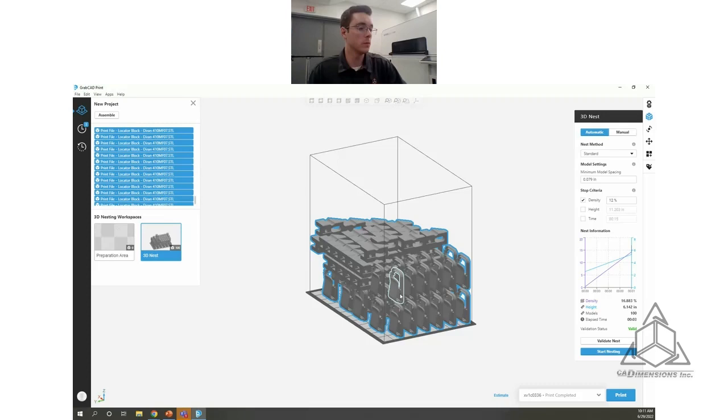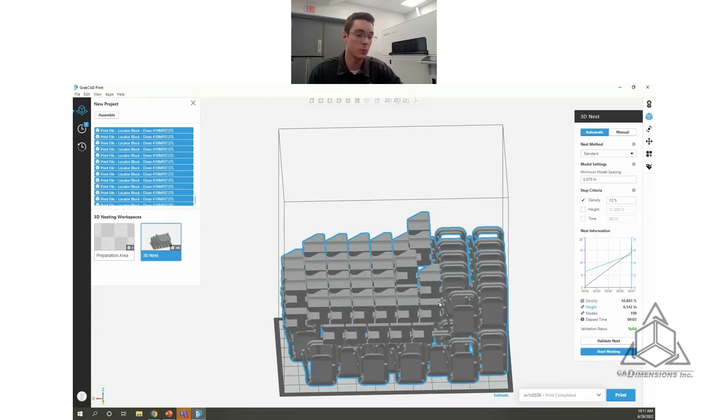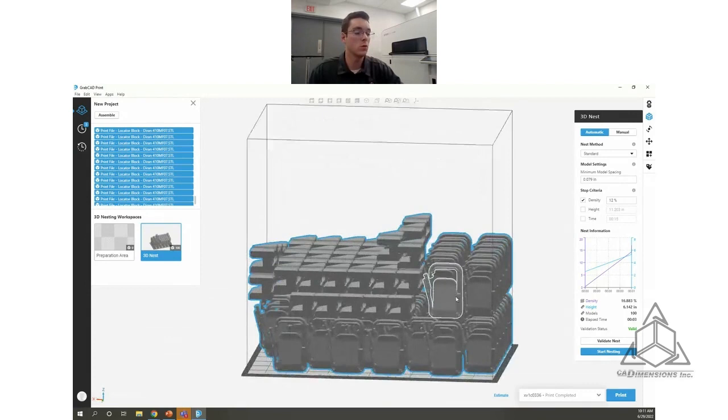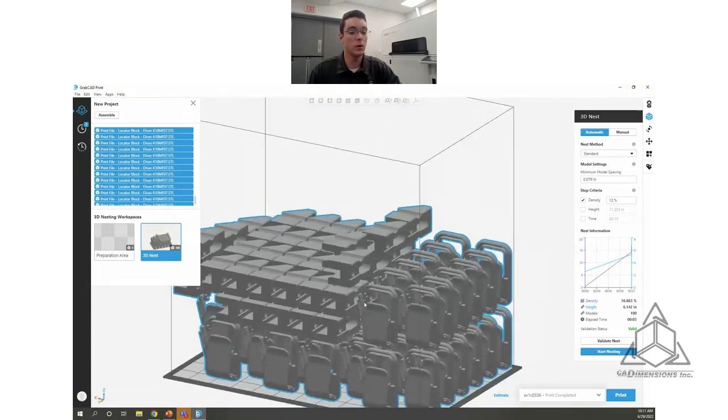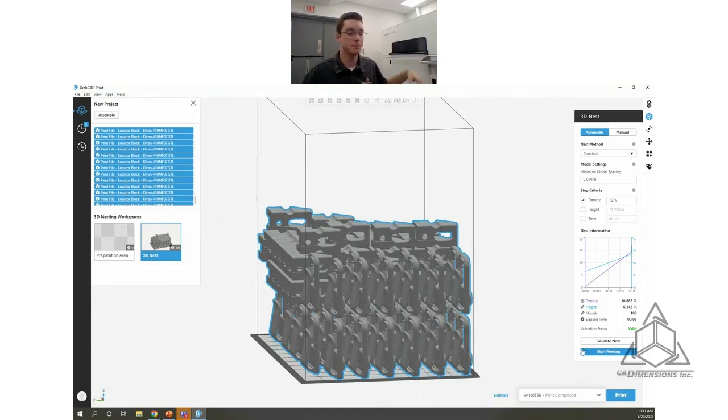As far as pre-print considerations go, downward-facing surfaces will generally have a better, more uniform surface finish than upward-facing ones. When it comes to orienting holes, overhangs, or bridges, there are a few considerations. But one of the best parts about this technology versus other 3D printing technologies is there is essentially no support material. Parts are supported by the unfused powder, which makes it really easy to prepare these builds. Once the build is ready to go, you'd hit print, it would send to the printer, and then you'd go from there.